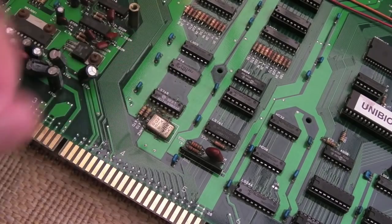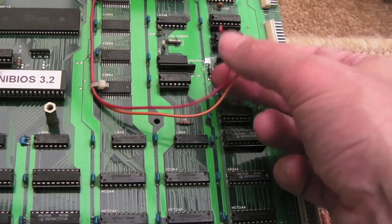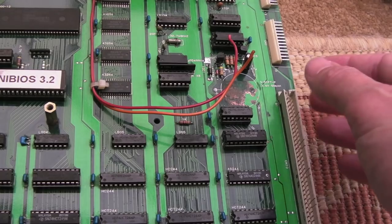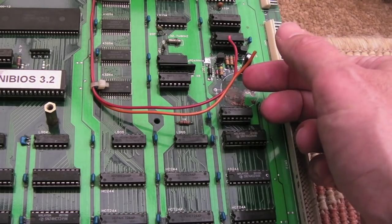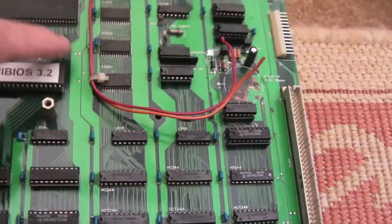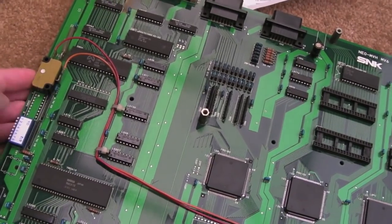Because I've done so much extensive cleaning, I want to just test it to make sure it's still working. The other thing I'll do is ground the strap there and solder onto the crystal these wires here. Whilst it's not an official mod — it's the micro switch on the corner of the board — I'll just put some heat shrink over these and label them up. I think one of them is VCC and the other is the wire from the battery, so it kind of goes back around to itself. When the micro switch is engaged, it could even be grounding the positive side of the battery when you take the board out, which would be dangerous when you power it up. In any case I'm going to leave this on here as a piece of history.